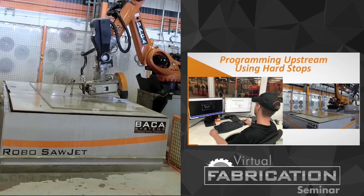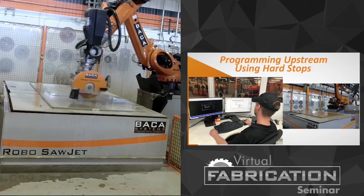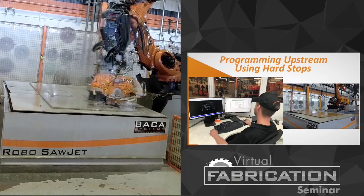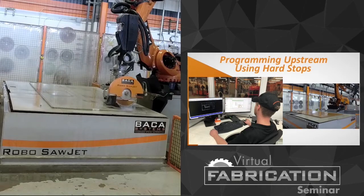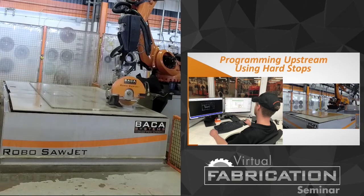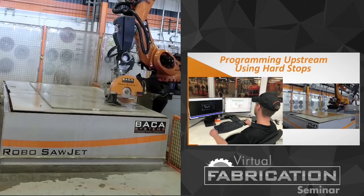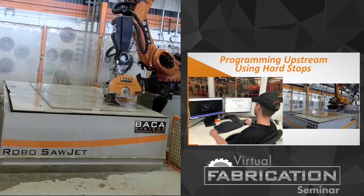The other thing that we like to do in terms of the robot and programming is it's very flexible. So I can use hard stops. I can use cameras. I can photo parts upstream. So whether you're a small shop and you want to program on the floor in front of the machine, or you're a big shop running super high volume and you want to do everything in the office pre-programmed so your operators are just hitting hard stops and pressing go, the robot is flexible enough in its software to be able to do that.